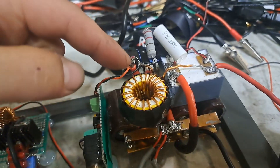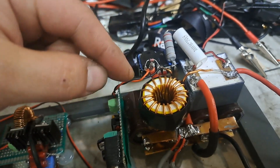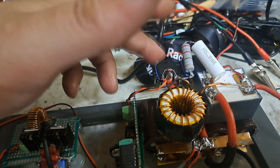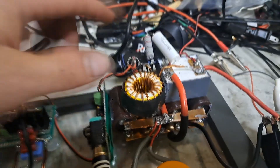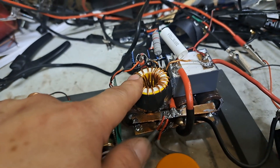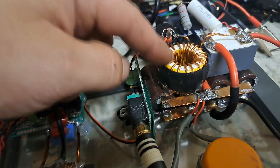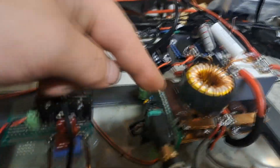I've got a cheap bootleg buck for the QCW that I'm just going to push to see what the limits are. There's a single 60-65 amp ultra-fast rectifier, playing around with some snubbers across it, a 20 microfarad cap, and this is just the same inductor I had from my first testing on the other buck — reusing that to see how it goes.